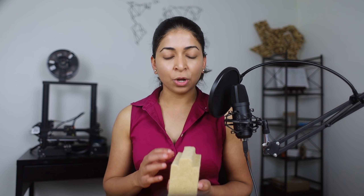Wood fiber insulation board is composed of ground-up, post-industrial waste recycled wood chips and shavings. A large magnet removes any magnetic impurities before the wood is shredded into small pieces. After that step, wood fiber insulation can be processed two ways: the wet or the dry method.